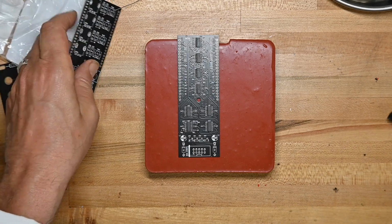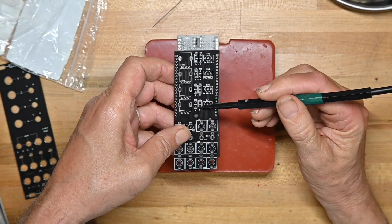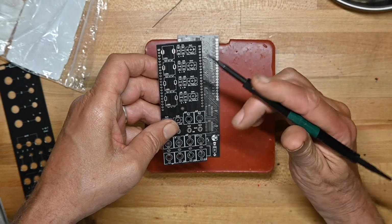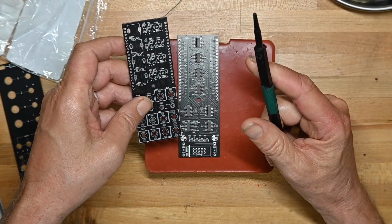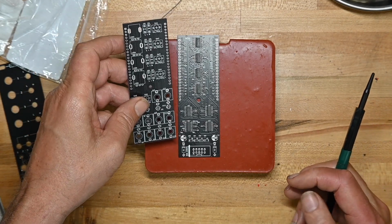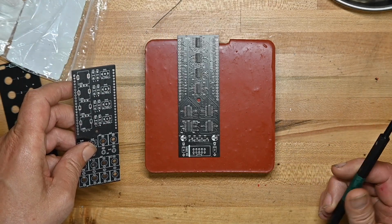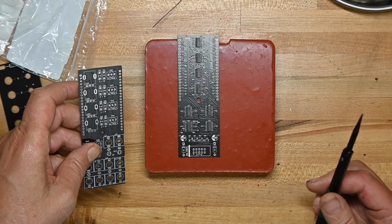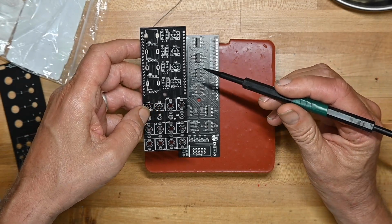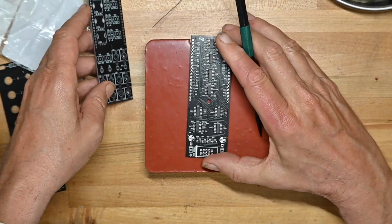So just a little comment on the capacitors here. The capacitors here set the rate ranges for low or high. So you can change them out, put other capacitors in, play around with it if you want, and see what works best for you. I'm going to go with the stock ones. You might remember we did this the other week with that other LFO that I can't remember the name of, that I changed some of the capacitors around to get different rates. But we're not going to do that this time. We're just going to go with the caps he provided.